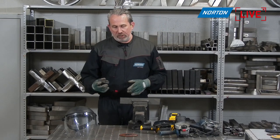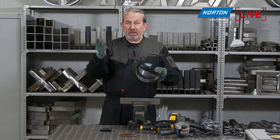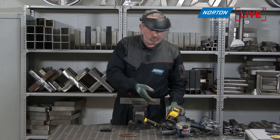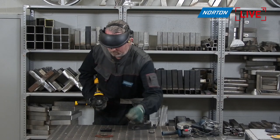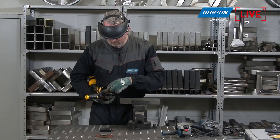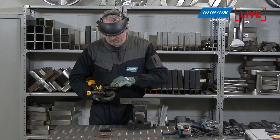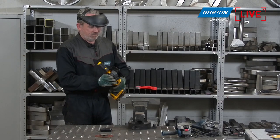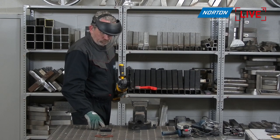I've got my safety gear on - safety shoes, flame-retardant overalls, ear protection, welder's mask, and heat-proof gloves. Derek, over to you while we do these cuts. When using a cordless angle grinder it's very important to keep oscillating the wheel within the material - make a saw-blade movement to keep the wheel cutting. You don't need to put any pressure on a one-millimetre wheel whatsoever. This oscillating action saves a lot of battery rather than pushing the wheel through the material.